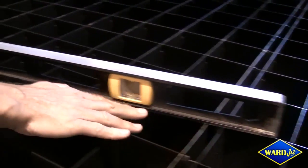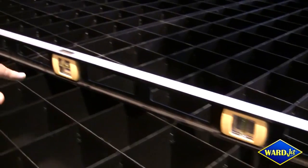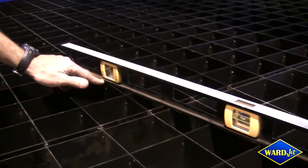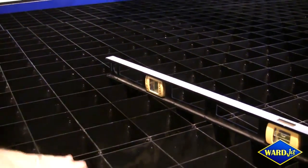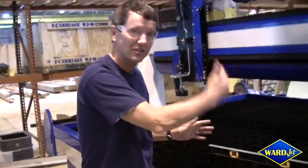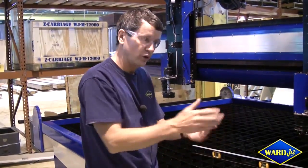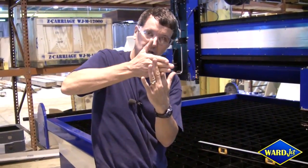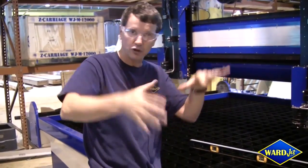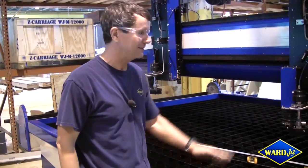So what you see here is a straight edge, and we are picking up the top of every support across multiple grates in the tank. That is very important. When you start going to slats, as you'll often see, and we can provide slats, they move, the abrasive gets underneath, they start to pick up, your material starts to wobble. It's very difficult to ensure something goes down flat.